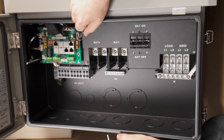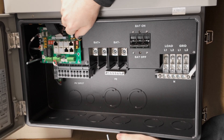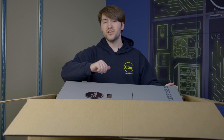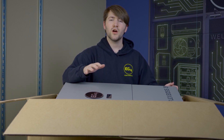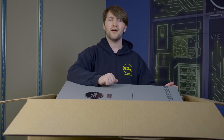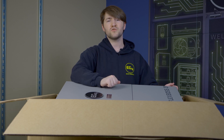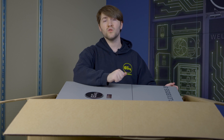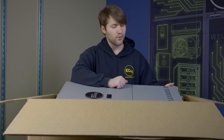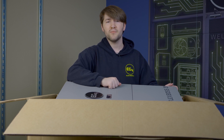We do have all of the additional things that you would need for paralleling, for RSD, running all of that in there, a battery breaker so you can disable that on an inverter basis, and our grounding — everything that you would need for a system. I mention the 18k PV a lot when talking about the FlexBoss 21, as we took a lot of those same successes and drivers and utilized them to create something that fits the GridBoss architecture super well, but also has a couple of additional superpower drivers — such as the 16kW AC continuous output when using solar and battery, as well as up to 21kW of solar input utilization, with a recommended maximum of 24kW nameplate rating so you can get the most even in those cloudy or off-peak hours. The FlexBoss 21 is a super powerful hybrid inverter that is perfect for whole home backup or being able to make the most out of your grid.